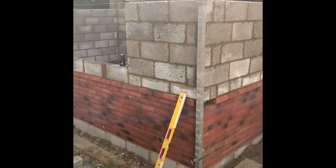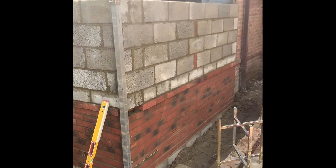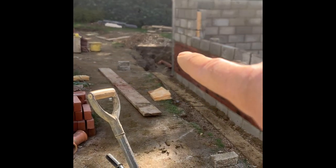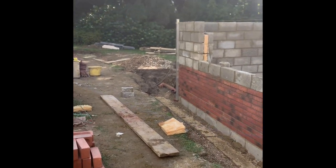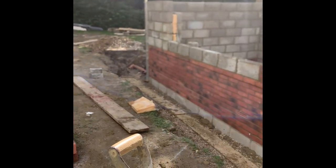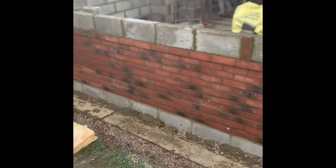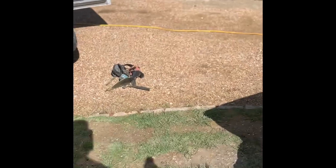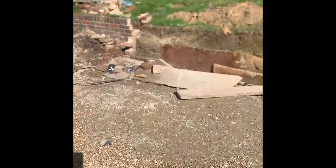Friday, mid-morning - we are up at scaffold height. Yesterday's brickwork from damp with corbel on both ends, then this morning took that end up to scaffold height, put a course of block through here, and me and Leon just took this end up. Getting profiles down. Corbel brick to put in that end. Leon going inside to take the pier up to underside of the steel, a few blocks on this internal reveal on both sides, one course of bricks to bring the inside seal up to match.